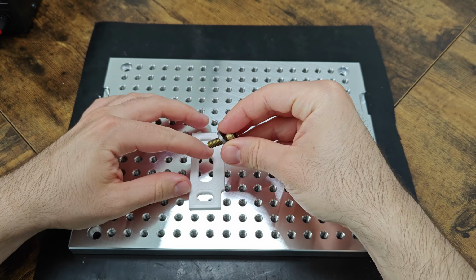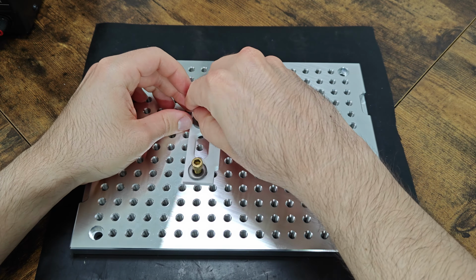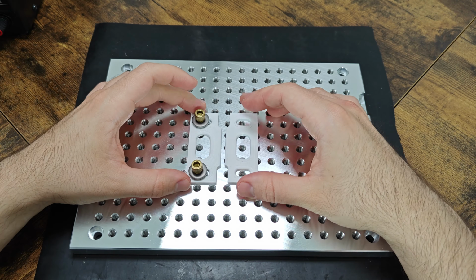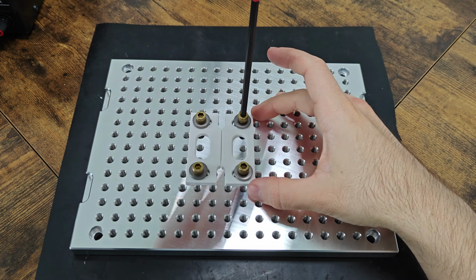I printed these plates with holes in them to make my life easier in keeping these pieces in place. You really don't want much of a gap when welding plastic, largely because of the tools that are currently available. We have to pre-place and preheat our filler material, so the gap really can't be that big. Plus, we're not going for 100% penetration welds in one pass here.